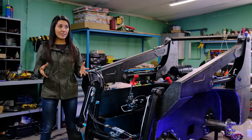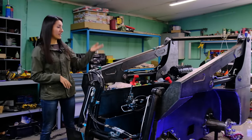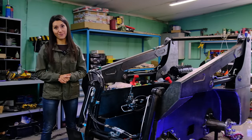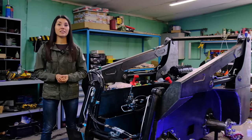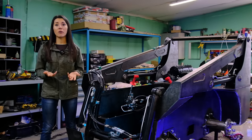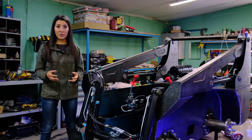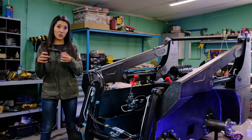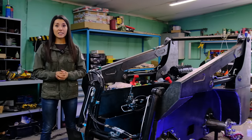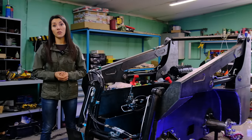It flashed through my head, that's it. The loader won't work normally, and apparently the oil is bad and trashed my brand new hydraulic system. But it turned out that there was just air in the system, which gradually had to be displaced by oil. However, it doesn't come out all at once, but is compressed and pushed out of the hydraulic cylinders, hence the twitching at first. And besides, the air in the system mixes with oil, which turns the oil into foam.